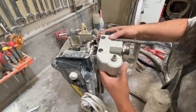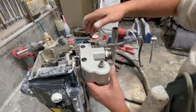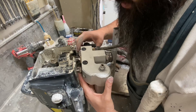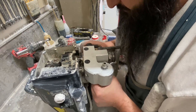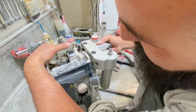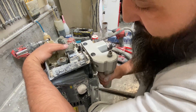This is a t-slot pump, so with a t-slot pump you don't have to set it up for a pin because it will just slide straight on. I'll get it to the point where it's in and then try to push it in by hand as much as possible, because I want these locking things — one there and one there — to line up with the holes in the pump itself. It's not always easy to do, especially with a new pump. It just takes a bit of jiggling; sometimes you might have to use a mallet.